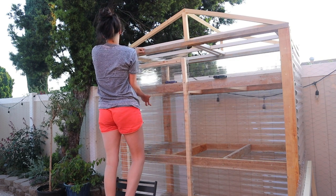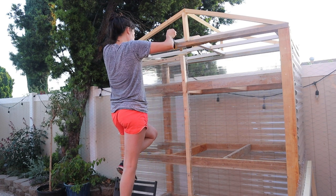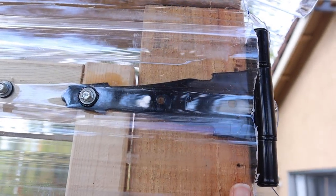I'm not saying this is the proper way to hang doors by any means, but I'll essentially show you how I did it by how I assembled the top roof panels. Essentially what I did was undo part of the frame, kind of peel the plastic back, add the hinge, and then once the hinge was attached to the door, I hung the door up using clamps — making sure it was exactly where I wanted it and level. Then I peeled back the side paneling of the greenhouse and drilled in some screws for the hinge to be permanently secured to. Not the most complicated thing in the world, but also not how you're supposed to hang doors — and it's working for me so far.